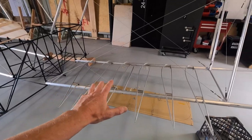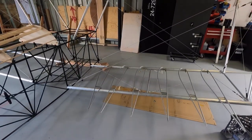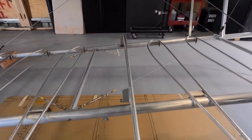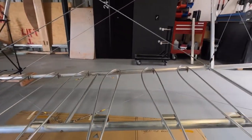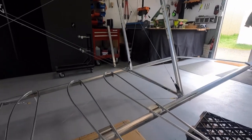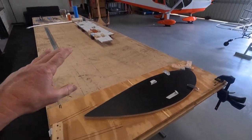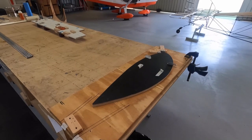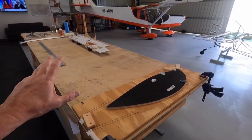Made up some wing ribs for the bottom — there are 10 on each wing. I call these all lefties because the brackets poke out to the left, but I need a right at the root and a right at the struts, plus two more lefties to finish this wing. Back to day one stuff — back to my stock, folding up some ribs. Going cautiously because you can end up folding too many top ribs or too many left ribs and run out of stock. Crappy job but it's got to be done.